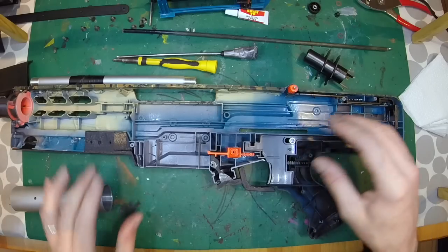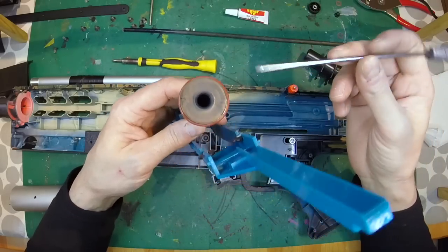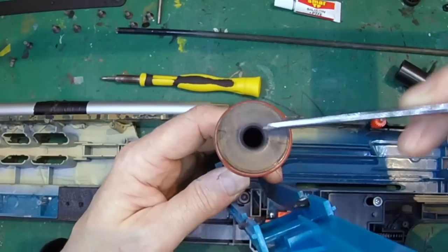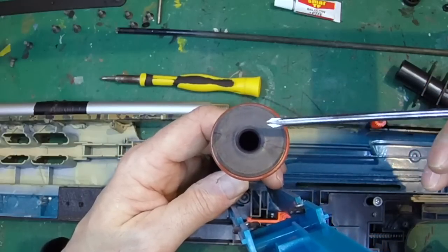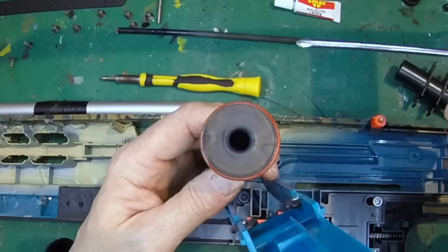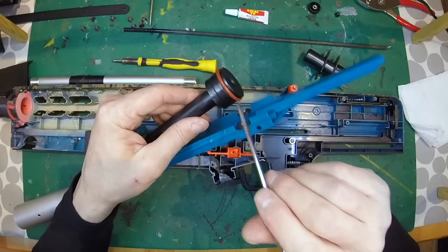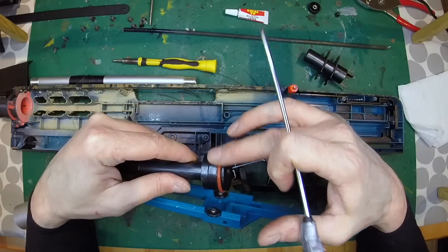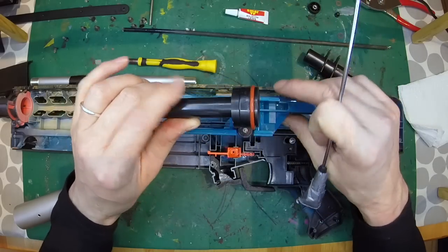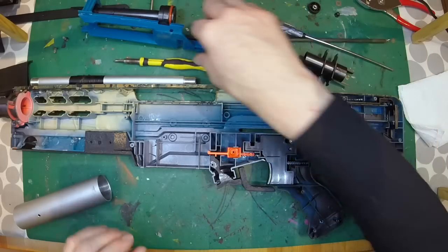Now we look at the bolt cup modification. The standard bolt cup as it comes from the Alpha Kit has a step between the cup head and the bolt tube — a straight edge. What I've done is radiused this, and ideally you'd radius it a bit deeper to turn it into a nice smooth venturi. Steps are really bad for airflow. You don't need to worry too much about the bore — that's not too bad — but you do want to remove that step. Then you fit the orange o-ring. You can see this o-ring's got a good layer of lubricant on it. The o-ring needs to be able to move — it's a sliding o-ring, not designed to be a tight fit. If your o-ring's too tight, change it. You want a nice easy smooth prime.